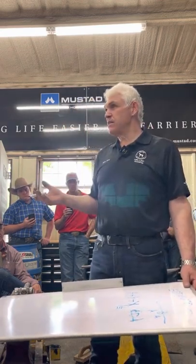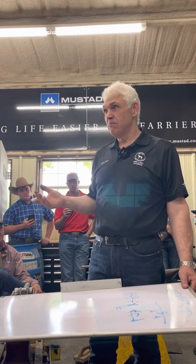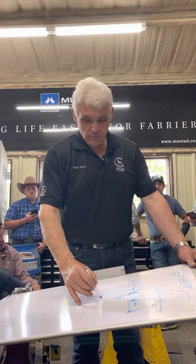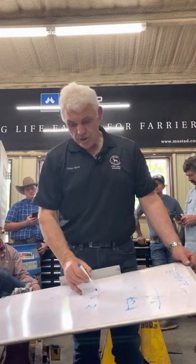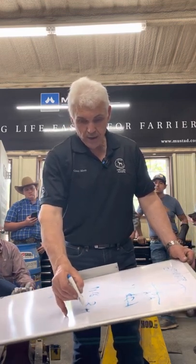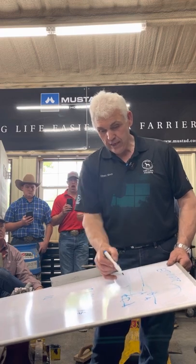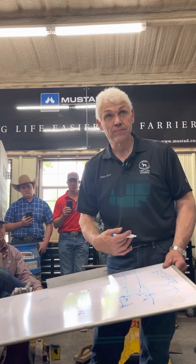Does anybody remember 16-2? What does that represent in the horse industry? How tall the horse is. It's an easy one to remember, isn't it? Dead easy to remember, 16-2. So, 16-2: for every inch, this grows by 1/4. So this was our 16-inch piece of steel that we've estimated. We'd mark it at 2 inches each side, and that's where we bend our heels and hockey stick it.